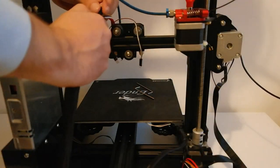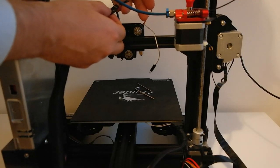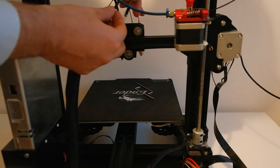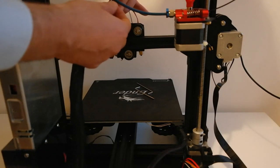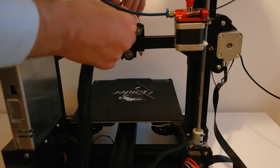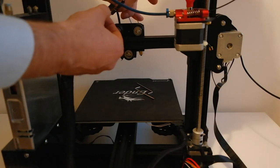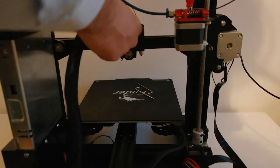And here they are. So this is logic or servo, and this is connection or sensor. Nope, like this. So black is on black, white on white, and brown, red, yellow, or brown, red, orange. Okay, this should be it.